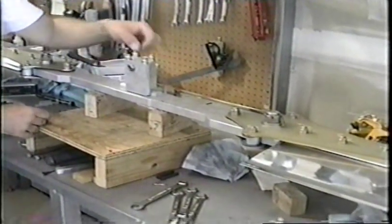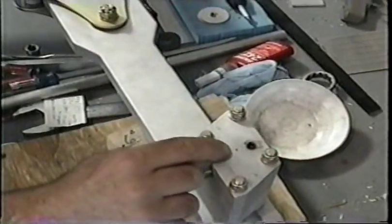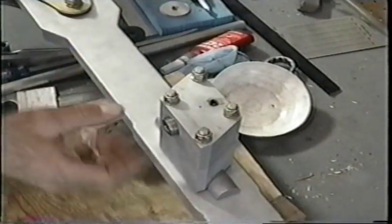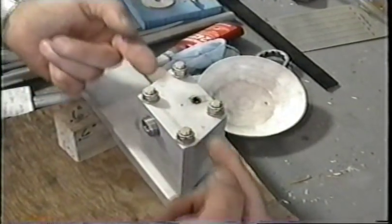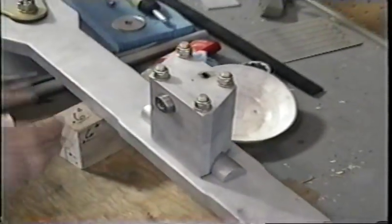The string would run right through this center dot here on the blade. When we string it tight, the line should run right through here — we want the string just running straight over the top, not dragging over the top, just floating in the air right through that center. Same with all the other rotor blades, it should be that way.